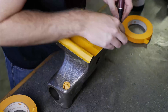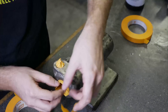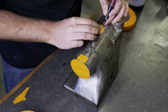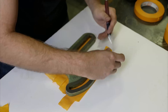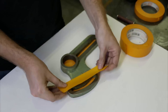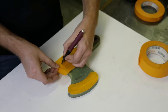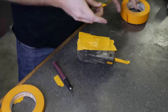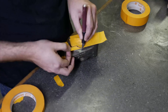Here you see me masking — we're going to be doing a lot of masking this episode. If you guys are curious about this orange masking tape, it's made by American; it's literally the American brand. Really high quality stuff, definitely better than the blue painters tape you find at Home Depot. It's a little more expensive but definitely worth the investment — sticks a lot better and gives you a nice sharp edge. You can see I'm using an exacto knife here as well. I changed the blade four or five times during this process just to make sure I was getting nice sharp edges. That's probably the most important part about the masking job — take your time on it. You'll always see that line once you're done painting if you didn't quite mask it off the way you wanted.